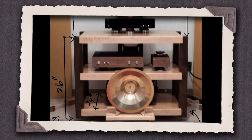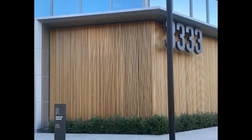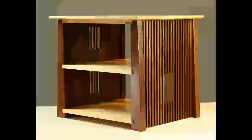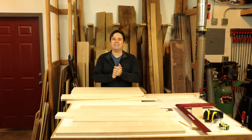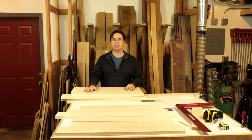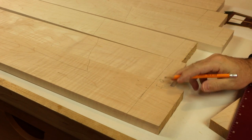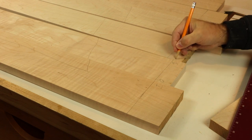Inspiration for this stereo rack came from a heavy unit with solid hardwood panels. We also wanted to throw in a vertical element inspired by architecture, with a splash of mid-century modern thrown in for good measure. This is a really fun point in the process where we get to start laying out the panels. We'll start laying out boards side by side and see where the figure looks best to come up with the prettiest possible panels. Once you have the figure laid out just where you like it, go ahead and label adjacent edges with I's and O's — that'll help us at the jointer.